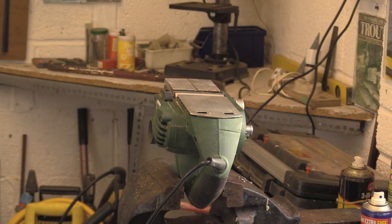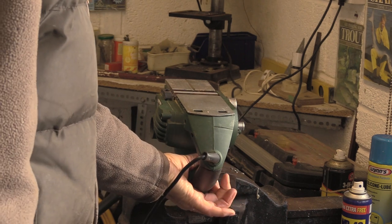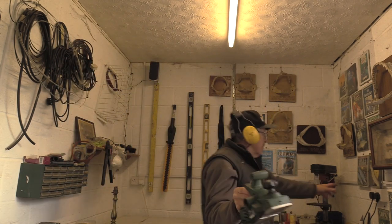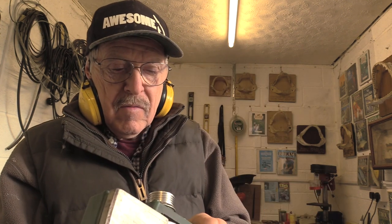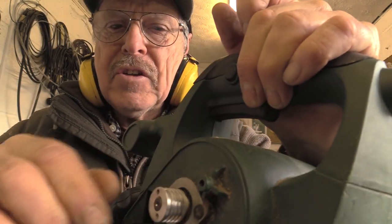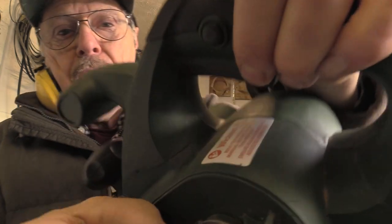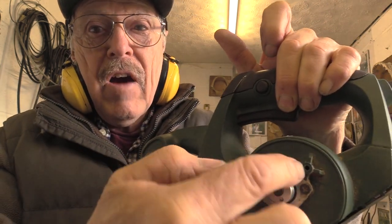I noticed a bit of change in pitch, so we'll give it another go and see if anything happens. After a good five minutes running, he said if the casing feels very hot there's something wrong with it - and I'd say no, nothing wrong with it at all. So potentially the motor's okay. But I've got to find the outside diameter of the pulley - he said has it got ridges, I said yes. I need to measure the outside diameter without going into the grooves or I'll give the wrong measurements.